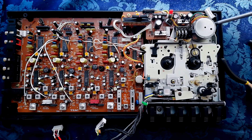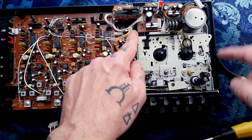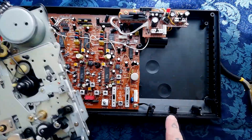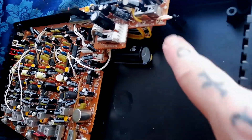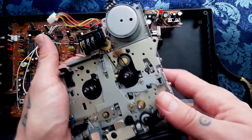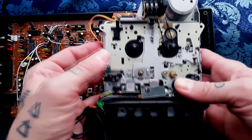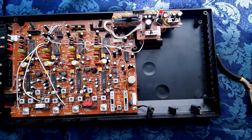There are four screws: two in between the buttons, one in that corner, one in the top right corner. Lift that out. In addition to those four posts, there are two plastic pins — one here and one just under there — that fit through corresponding slots on the metal chassis of the transport. Refer to my videos already up on my channel about the GEC transport for how to change any of the rubber parts or manage any issues you're having with that.